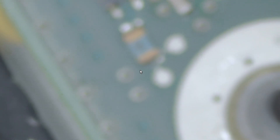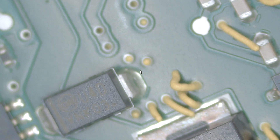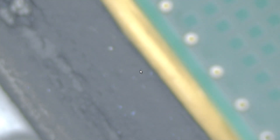And as for those streamers I mentioned earlier — if you look at the underside of the board at the edge, you can see there's this orange stuff below the PCB edge. Basically that's the potting compound that's underneath and coming through the vias on the board.